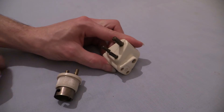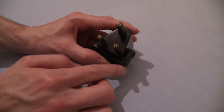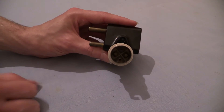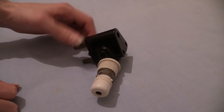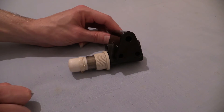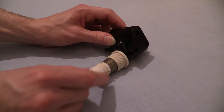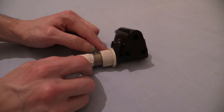If you didn't have a five-amp three-pin socket available, remember you could use something like this - a three-pin 15-amp which is British Standard 546. Around the side we've got the two-pin adapter which is British Standard 372. Get that straight in there, connect the iron in the side, put that in the wall socket and away you go. There's also an outlet on there so you can plug something else in as well. These adapters are unfused, so if you had something drawing 12 or 13 amps and then added a 250-300 watt iron, you'd have to be careful not to overload the socket.